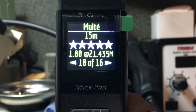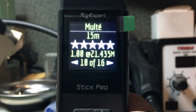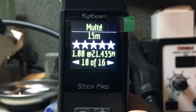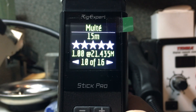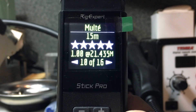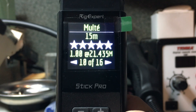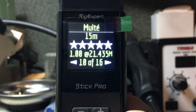For example, if you have a multi-band vertical antenna that only works on 10, 15, and 20 meters, the scan would ignore all non-resonant bands and only display where the SWR was good on those three bands. Within 15 seconds you get a really good idea of the lowest SWR for each resonant band — a great quick-view method. A 15-second measurement gives you up to 17 different bands in ITU Region 2, showing the lowest SWR dip and its frequency automatically.